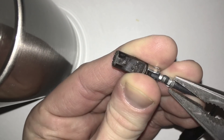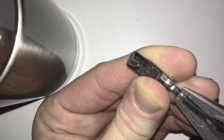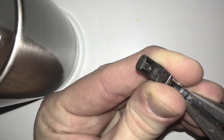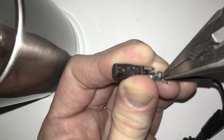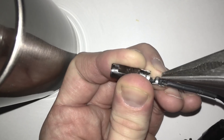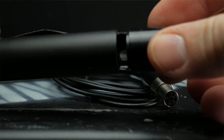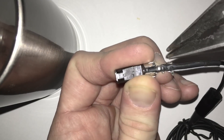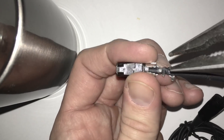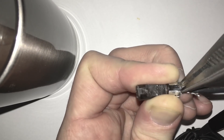If you're working hardwired, you can go with either positive or negative bias as long as the microphone and the power supply match. It's important to note that if you plan to use phantom power, you'll want to get the positive bias, as the negative bias TR79 supply only works on the internal battery. If you're using a wireless transmitter, however, you'll need to get the correct bias for your specific brand and model of transmitter, as some are different and not all will work with both positive or negative mic elements.